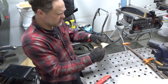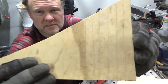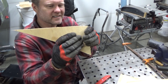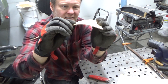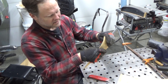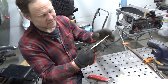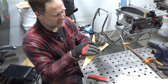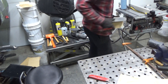I know it'll bend backwards away, but you can get it to — just score it lightly. It could be a little deeper, and you can kind of hear it starting to crack and creak as it goes around. It does bend down pretty decently after it's been scored like that. If you score it on the side where it's bending in — the concave side — it won't break as easy. If you score the outside and try to bend it so the scores are on the outside, the wood fibers will kind of break because they're having to stretch. Wood isn't like metal, it doesn't stretch, but it can compress a little bit since wood is a little soft.